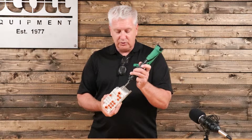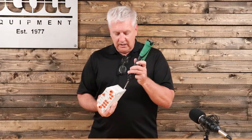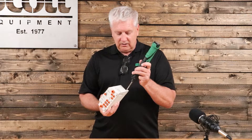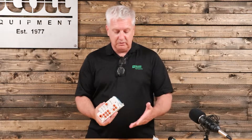Three screws — could be two if it's an SY 3000 — but basically on a 5-7000 combo, it's three screws on the end: one, two, three, and we just take it apart. It basically just slides apart and falls down. Be careful, don't lose the screws — they are special screws. They are easy to get again through SMC, but we don't want to lose one. We want to put it right back together.